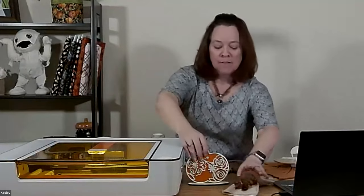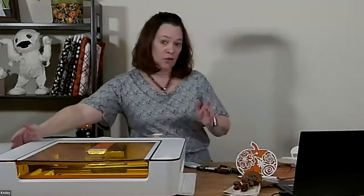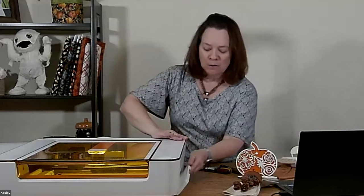If you want to use larger materials, there are side pass-through doors on each side of the tray that allow materials up to 12 by 24 inches. So it can't cut wider than 12 inches, but you can cut longer — a board that's 12 by 36 or even 48 inches. In the software you'd just move the board forward and realign your image as you go.